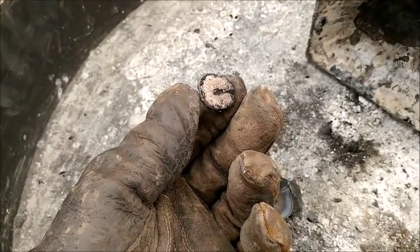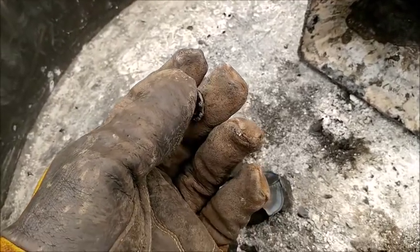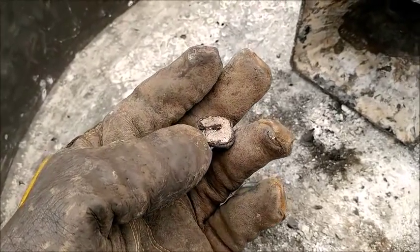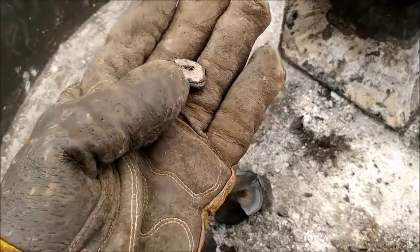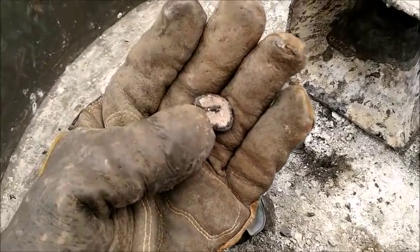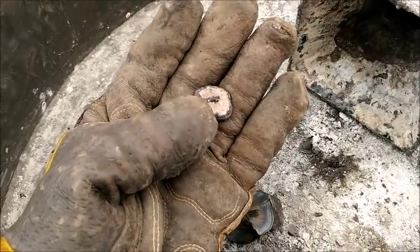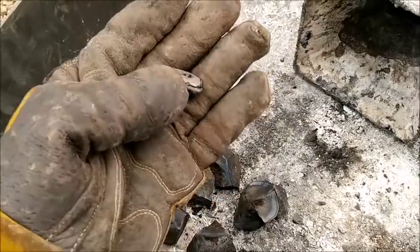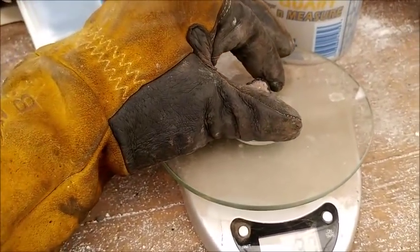And again, this was just adding iron to our basic flux and our 100 grams of stuff off the shaker table, and we ended up with a little metallic button. So we reduced the less reactive metals than iron by putting metallic iron into the mix. So here's our little metallic button from our first experiment.